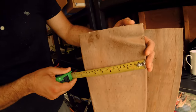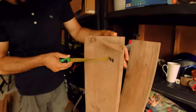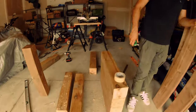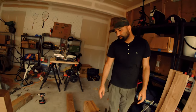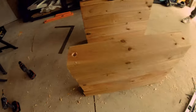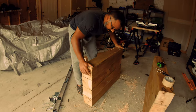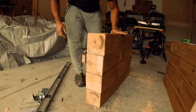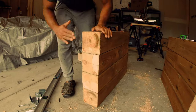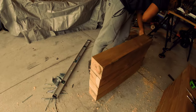The width is never exactly what it advertises either — it's not even eight inches, it's more like seven. Wood is never exactly the size it claims. All four pieces are connected now — you can see there's a hole on top, but we're just going to flip it upside down. That way there are no holes visible on this side, and it's pretty straight. We'll sand both sides down and we should be good.